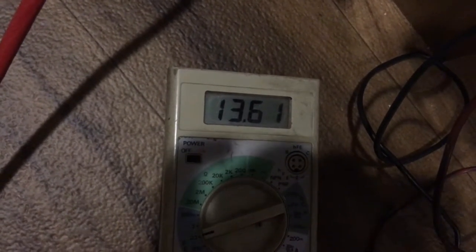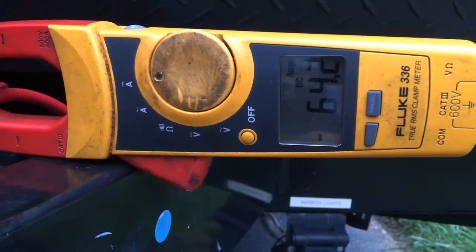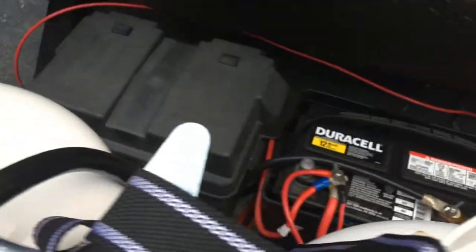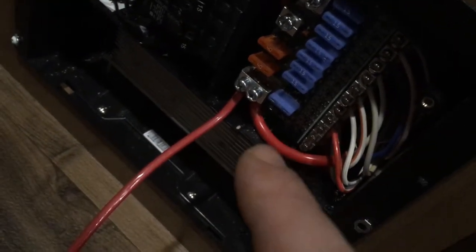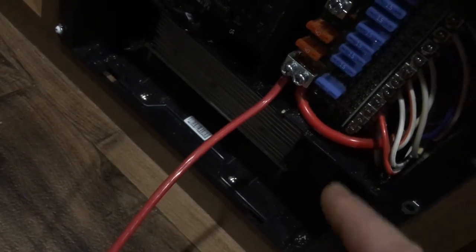15 minutes into it — 64 amps, holy crap! I'm doing this right with two wires. Since I added this wire, 64 amps. This thing's cranking away. I guess I could get number six wire and run it properly under the trailer and put another breaker. The eight gauge gets more amps than the number six, I think because of the breaker.